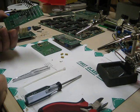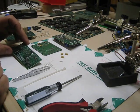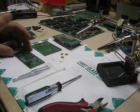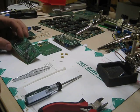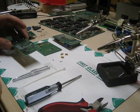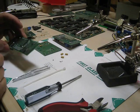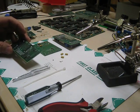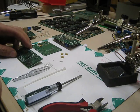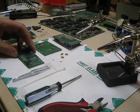Sometimes I'll put the desoldering iron on one side and the other soldering iron on the other side to get the solder to flow well, especially for taking parts out that just don't seem to want to come out. When putting your LEDs in, once you solder them in place, make sure you've got them where they're supposed to be — because once they're soldered, you're going to have to cut them out and it'll be difficult to get the little piece out to put a replacement in. The kits come with a few extra LEDs for all the different colors, like four or five extra ones.